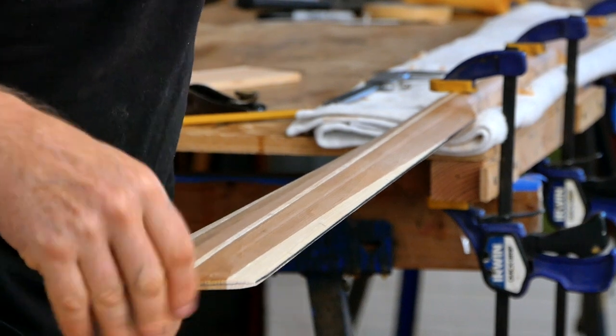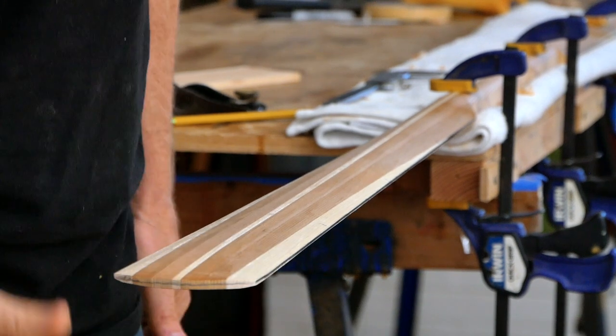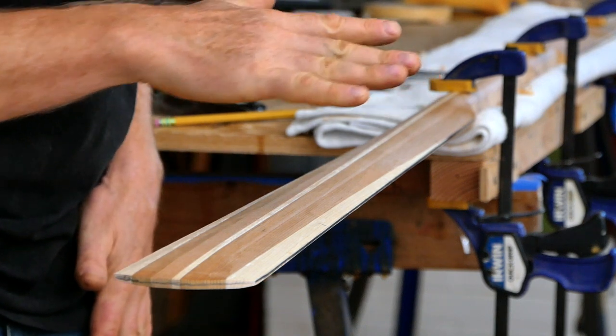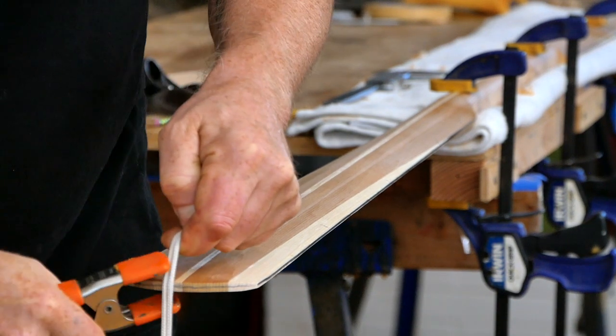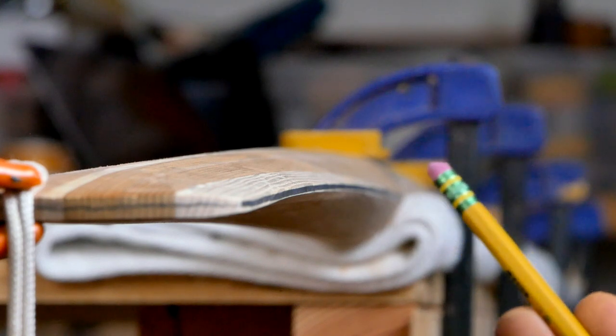Getting back to the flex — the exact amount is a little bit difficult to quantify because how much the blade flexes with a certain weight hanging off it would change depending on the size of the paddle and the species of wood. So it's more important to look at how the blade is flexing rather than exactly how much it's flexing. For example, I'm going to take a 10-pound weight and hang it off the end of this paddle, and that's going to cause this to sink down about one inch. I want you to notice the curve of the layout line along the edge — what you want to see is either a continuous curve all the way from the root of the blade to the tip, or even better a little bit of a progressive curve that increases toward the end.